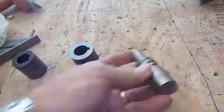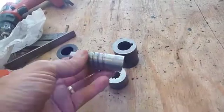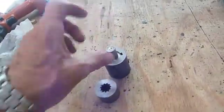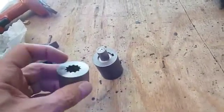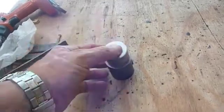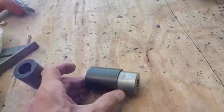To facilitate that, I made a plug that matches the one-inch on this side and also matches the inner diameter of the spline shaft on this side. So we just put that together, clamp it, and then we can weld.